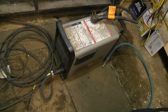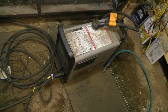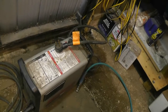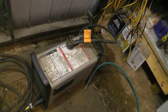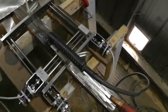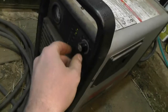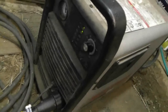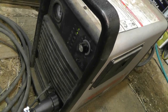This thing's packing a sulk — it tripped the breaker is what happened. I'll have to sort that out. I'm hoping that whatever intelligence the thing has inside of it will recognize that it's been unplugged for a while and reset something inside. Basically, as soon as I turned it on it turns on the air and just keeps running air through the plasma cutter tip. Here's a detail: when you dial this below 20 amps, it turns on the air — that must be just something you can set up to cool off the tip when it's hot. Okay, so there's nothing wrong with this guy — I just tripped the breaker. So I'll run it now at 20 amps and go from there.